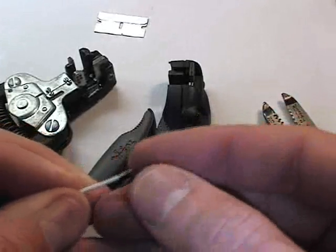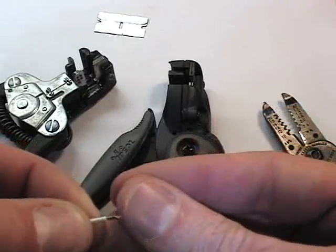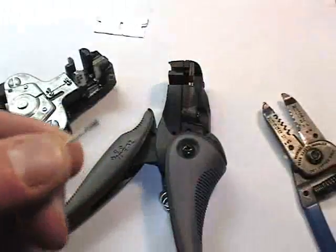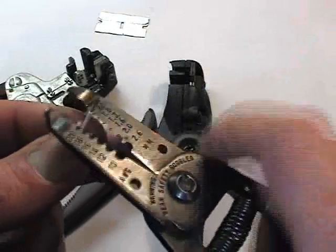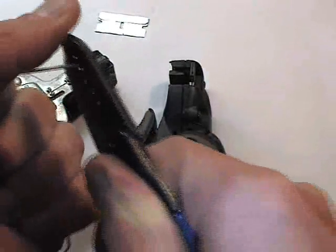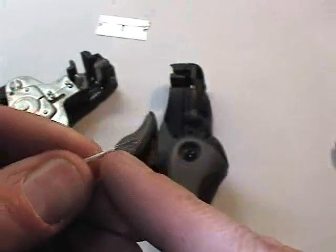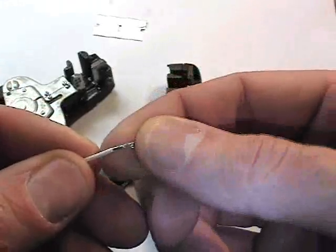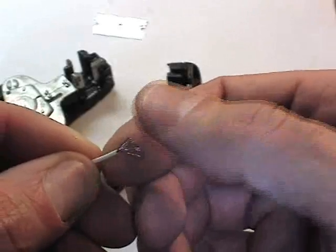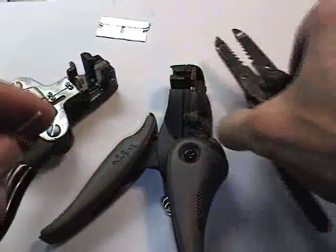Now what's very important is that this is 16-strand wire inside, and each one of those strands is very fragile. When stripping wires, until you really get the feel for it, what you want to do is practice — strip the wire again just a little bit further, then examine closely at the location of the first strip and look for strands you may have nicked. In this case we can see we had a pretty good strip because none of the strands are broken. Go ahead and cut that off with some diagonal cutters.